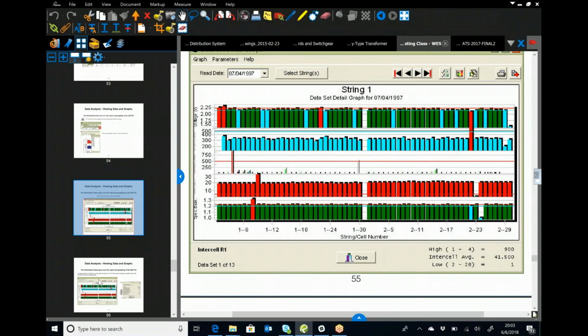So realistically, when it comes to batteries, in acceptance testing, we're looking for a manufacturing flaw. We're looking for some issue with that jar that they need to get warrantied out right away. If we're doing maintenance testing, then we're looking at, okay, do we have any data that they've collected over the years? Here's where it sits right now, and all we can do is a best guess off of the manufacturer data if we don't have all of that previous data.